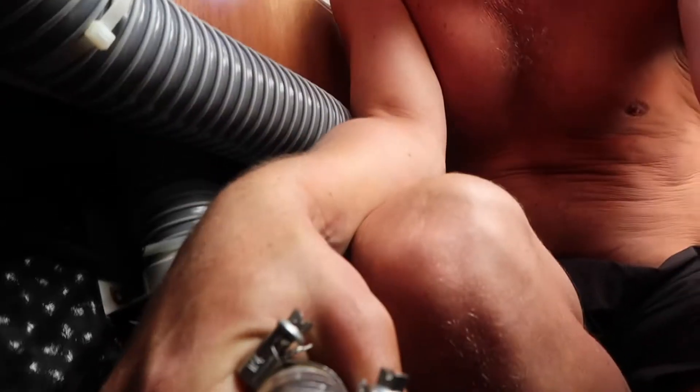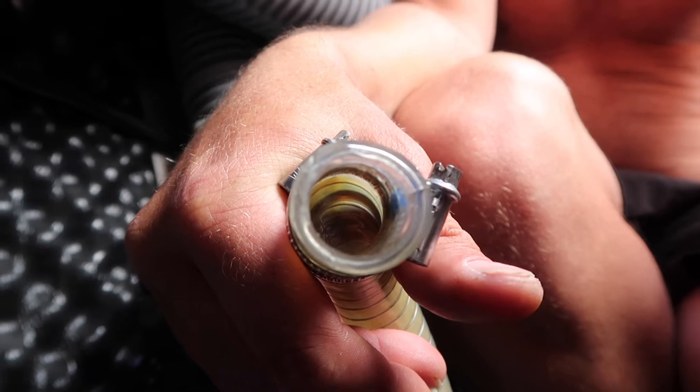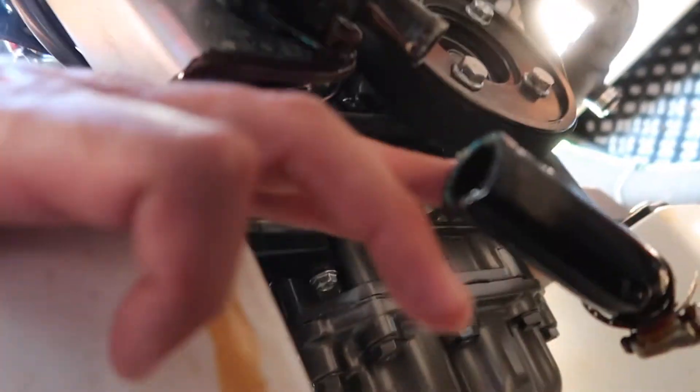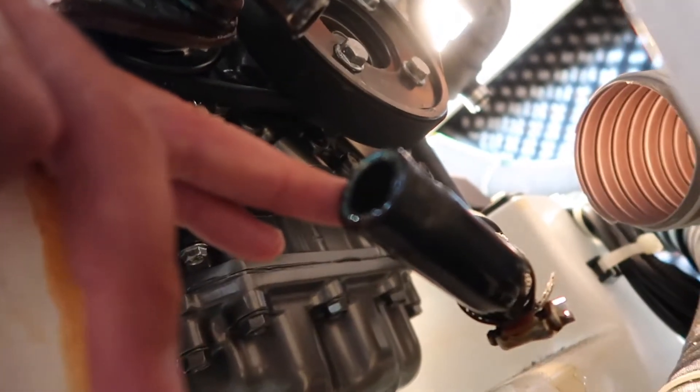Okay, we've got the first hose off. It looks good. There's a little bit of scaling inside the hose but otherwise it looks good and it doesn't need to be replaced. Undoing the second hose was a lot more difficult. Unfortunately this hose is on the downside of where the leak is so it was quite encrusted with salt, and I had to pry it off with a screwdriver. We'll check that hose in a bit to make sure it's not damaged. I have a spare hose on board if we need to replace it.